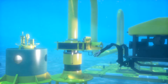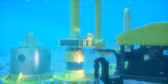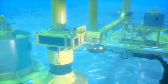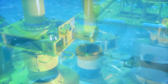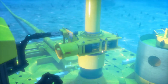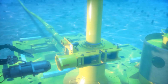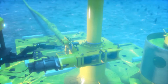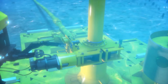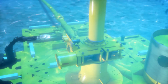The softland system is disengaged and the tool is removed. Engaging the softland system again lands the jumper and compresses the seal between the hubs to complete the connection. The annulus test confirms the completed connection.